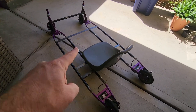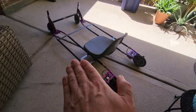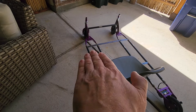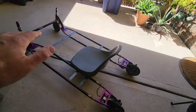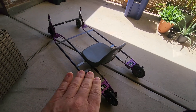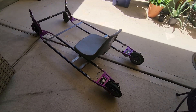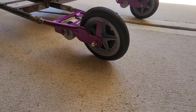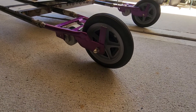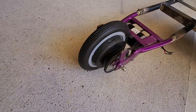As you can imagine, lots of measurements to make sure the frames aren't tilted and are parallel - basically checking all six axes to make sure everything lines up. It does, within fractions of an inch, which is really good. To make it a little more comfortable and a little quicker, there are bigger wheels on here. Adapting the original sprockets onto these bigger wheels was quite a challenge, but I figured it out.